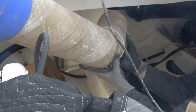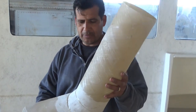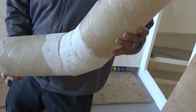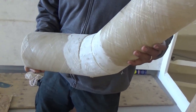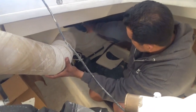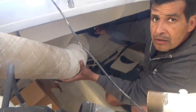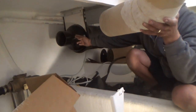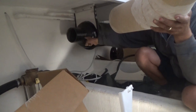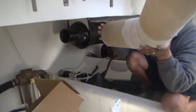It was a 45, so that means I've got to go like a 35 or 40. We got this FRP tube mocked up — a little down tube and elbow on the end. We're going to try it and see how it fits. My next step is to remove the muffler, glass the end of it, and drill a six-inch hole. We're going to actually modify the end of the muffler — cut this off, glass it, and drill a hole right about here so it can come out to this end.